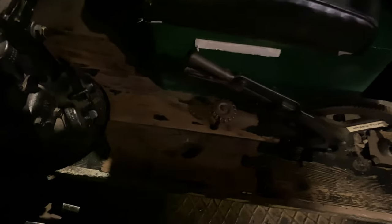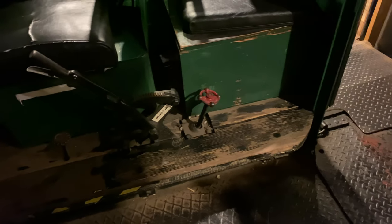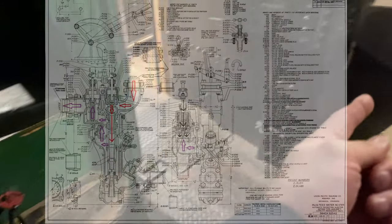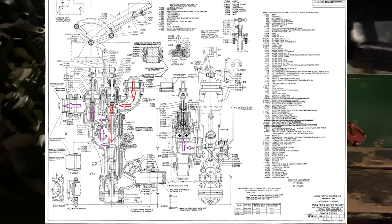and you would put the injector into the priming position. And what that does is, once again, you're cracking the steam valve and the water valve slightly. So what is happening now is, because the water can't flow out of the overflow and you're supplying steam as well, the steam heats the water in the body, and it is forced back into the tender through the piping and such. So you're basically keeping the pipes warm and you're preventing them from freezing.